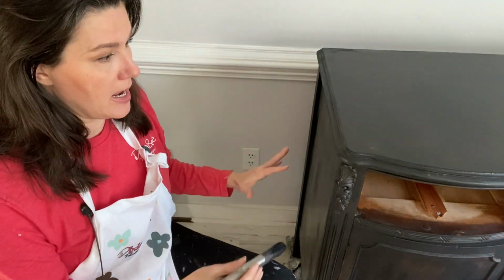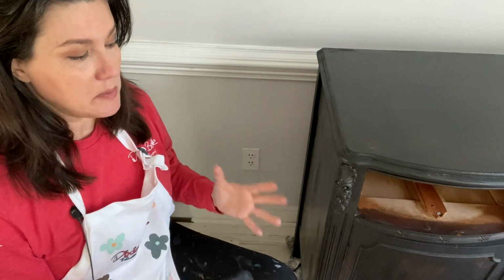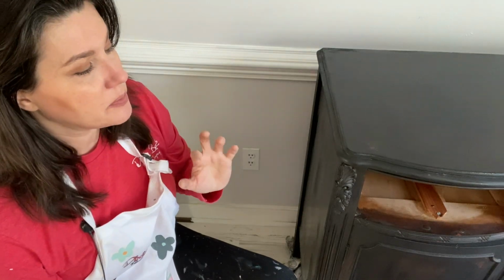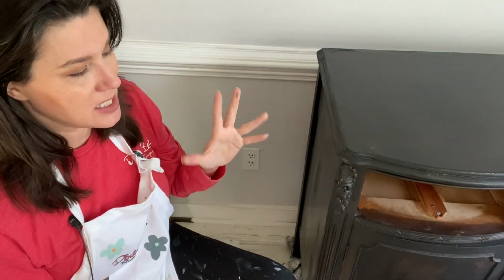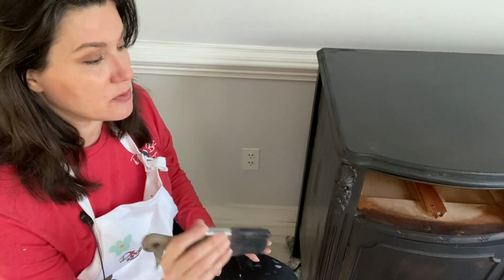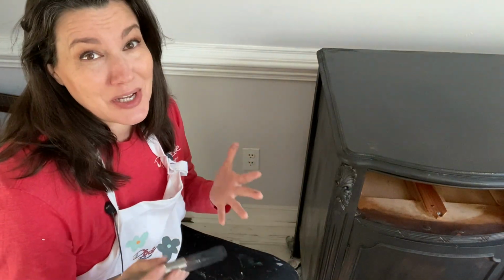It's going to dry and it's going to cure and it's going to give me a good base to start off from. When I lay down my ombre colors, you're going to see me go kind of from dark to light. My plan for this piece is a little dark, a little bit brown and black mixed together. We're staying in the au naturel tones. So doing this nice strong base coat before I get in there with that best dang brush and start really pushing my paint around is going to ensure that maybe I only have to do one ombre blend instead of two. Having that nice dark base, if I pull any paint back or sand back, it's going to show through the bottom. So I hope that helps you in regards to why I do this initial base coat, because I get that question a lot.